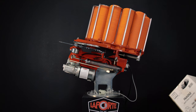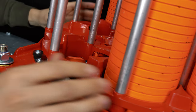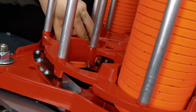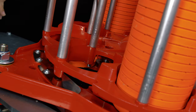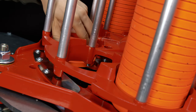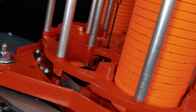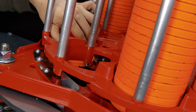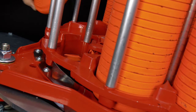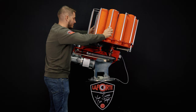If your trap is fully loaded, remove the three columns of targets above the hole of the throwing plate. Place one clay between the two knives and check the knife setting. The clamping screw is accessible through a dedicated slot — use it to adjust the clay, and don't forget to rotate it. With a second clay, check that the knife separators are correctly adjusted by pushing the magazine manually.